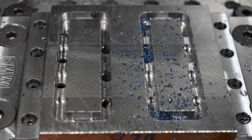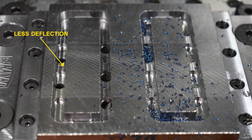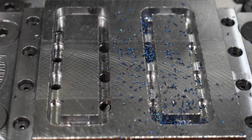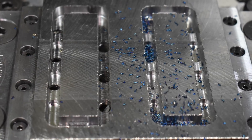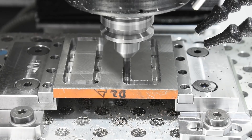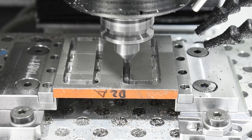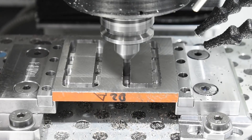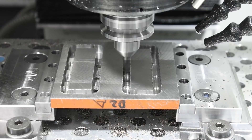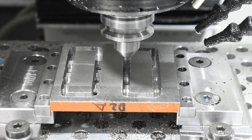The test part showed much less tool deflection on the sidewalls with the slotting toolpath that was pre-drilled. The cut sounded better and more consistent, and chip evacuation was way better with the pre-drilled holes. It's hard for me to tell you exactly how well this worked because we only made two cuts, but if this was my job — if I had to slot with tabs day in and day out — there's no reason why I wouldn't pre-drill.